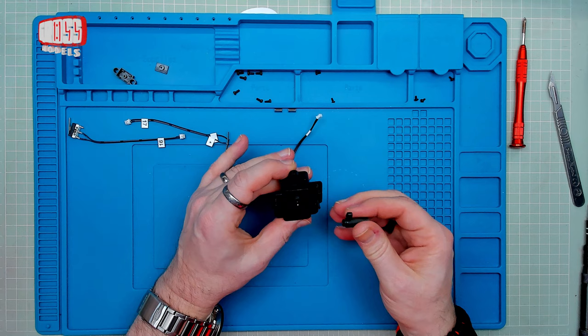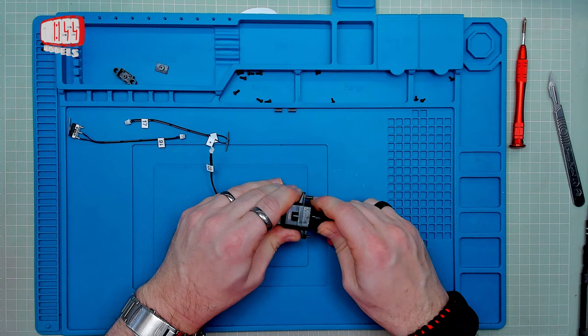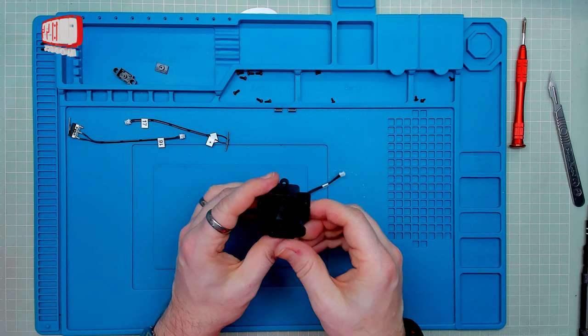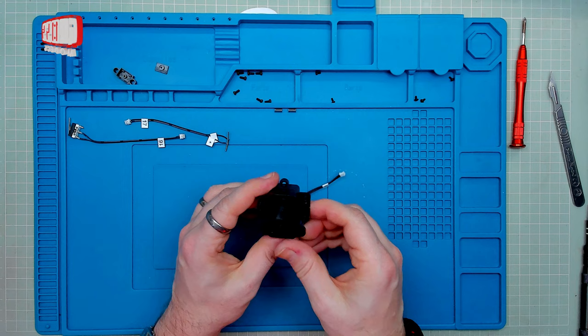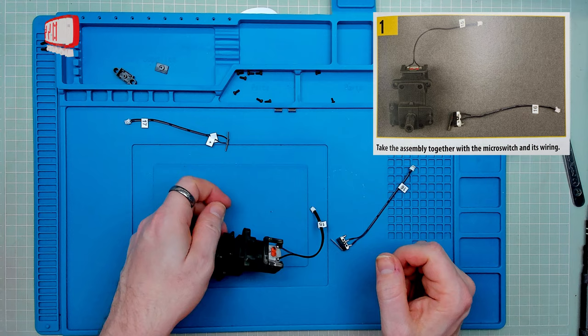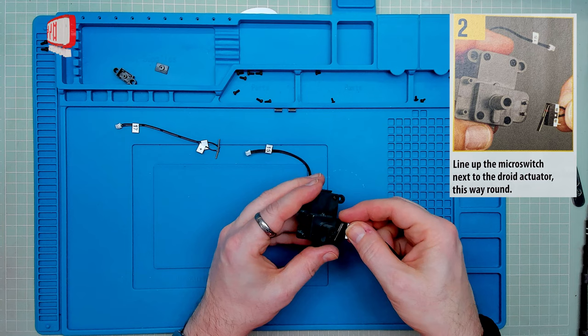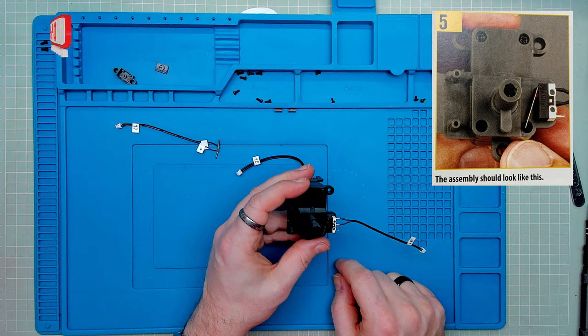We need this post - it's going to jam onto there. That's why that bit's knurled, because it's going to fit on there like that. Go on there a bit further. So that is going to rotate a bit one way or the other when the power goes through. We're taking that along with the switch, getting it the same way around. Line up the switch next to the actuator this way around. The switch is going to get turned on and off when that gets rotated around. So that fits over the pins like that - as that goes around, it's going to click the switch.